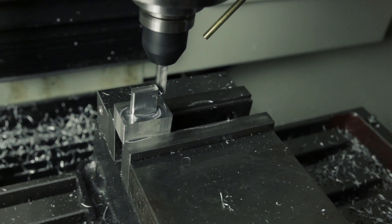I like to take a big depth of cut when you're roughing because then you don't wear the tool out on the bottom. When you come back to finish, if you're using the same tool for both roughing and finishing — say you rough with the bottom 100 thou and run it for 40 minutes — that bottom of the tool is going to be worn a little bit, and you'll see that wear line in the finished part.